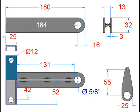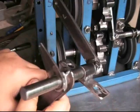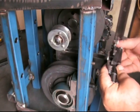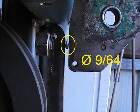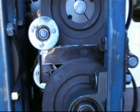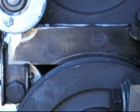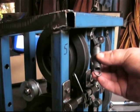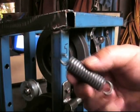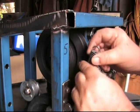The next thing to do is install the spur to the trunnion, sliding it until it rests hard up against the outside face of the T-arm. Then install the belt actuator back into the transmission frame and set the actuator mechanism back to its neutral position as you have done before. Now with the T-arm held firmly in the neutral position, scribe an arc following the circumference of the pulley onto the face of the T-arm. This will give you an accurate reference point for setting the neutral position for the belt actuator assembly. The next stage is the fitting of the neutral return spring to the spur — you will need to use a spring strong enough to hold the weight of the T-arms and rollers in the neutral position.